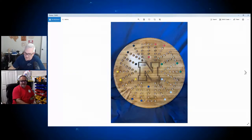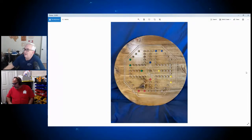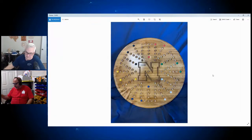6-player Wahoo board, 16 inches diameter. Then image 20 is the same board, just flipped over and made the 4-player version, so you have both in one board. So yeah, on this side you got the 4. On this side, you got the 6. Let's see, 5/8 cove bit for marble spots, 45-degree V-bit for carving, and a 1/4 inch end mill for the profile cut. Again, pine material. Super cool. Great stuff, Brian.